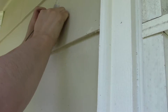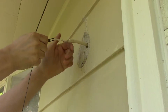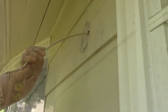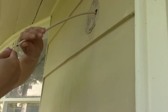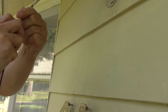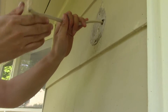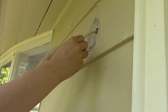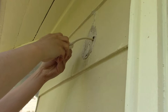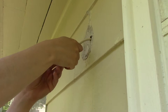Now we're going to pull the wire through very gently, because sometimes it'll catch inside the wall — you don't want to pull off the snake that was tied to the wire. Once we have it outside, we disconnect the snake and take it off. Then, just to play it safe so the wiring doesn't get pulled back into the wall by accident, we're going to tie a knot in the end of it. That knot keeps the wires from accidentally being pulled through the wall while we work.